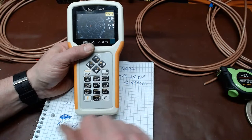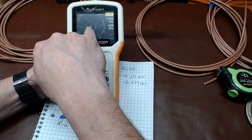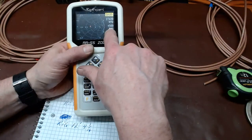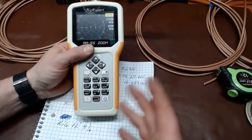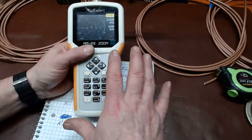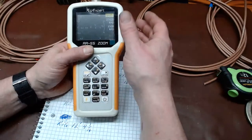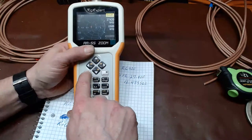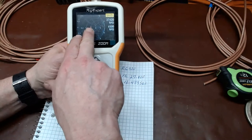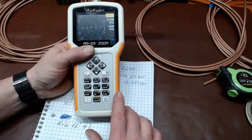Okay, now one of the things that you're going to see, we're just above our zero reference looking at that. They're giving us here plus or minus 500 kilohertz as far as on the other span. So not a lot of adjustment as far as on looking at it on the Smith chart like you would if you actually hook it up to a physical antenna. A physical antenna is going to show you a little bit different thing. So we'll run that again, as you're going to see. So again, both of them are going to give you nearly the same information and some of the same attributes.